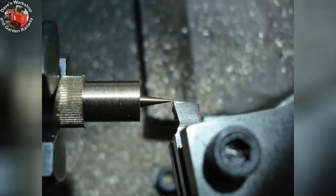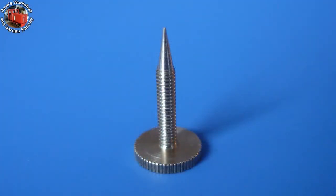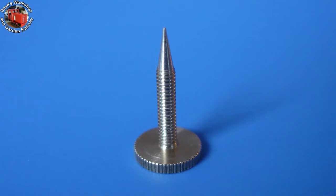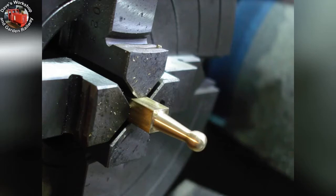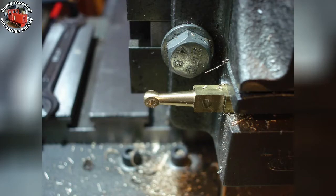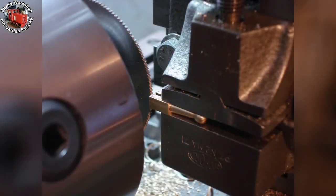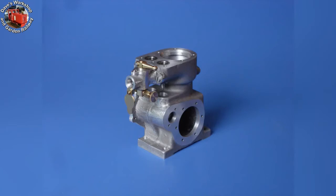Needle tip next, as it is furthest from the chuck. This 20-degrees inclusive angle is generated by using the compound slide set over to 10 degrees. Here is the finished part. The nearly complete carburettor mounted to the engine. The start of the throttle lever — milling the flat on the end of the lever, both holes drilled, slitting the piece so that it might clamp the throttle rod. The carburettor is complete. That brass choke plate took a lot of making — in the end I printed it on paper, pasted it to the brass sheet, and filed to the lines.